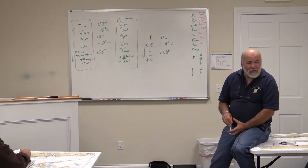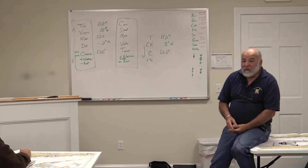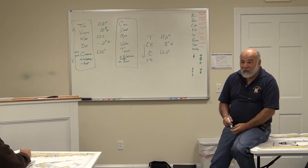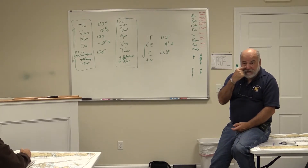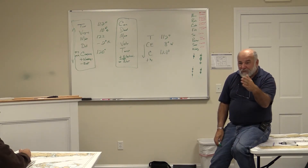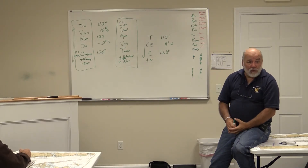They give you a little deviation table in the book. But most bigger vessels, you're going to be handed a deviation table with your boat when you buy it, because somebody has spun that compass and figured it out. For every direction that the boat heads, that needle is pulled off — it's deviated in a different way based on its relationship to the metal in the boat.